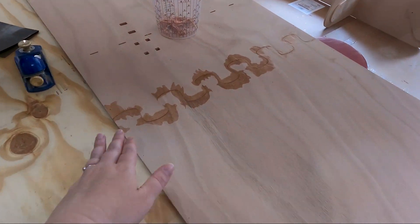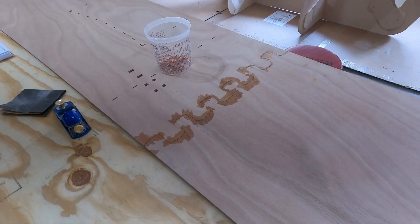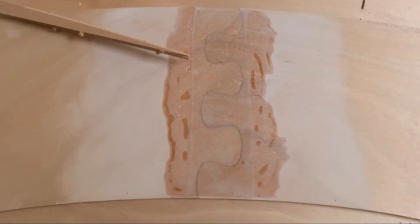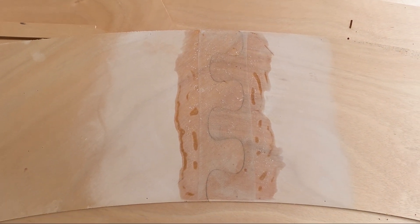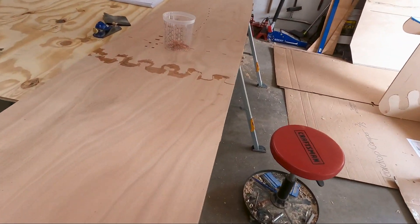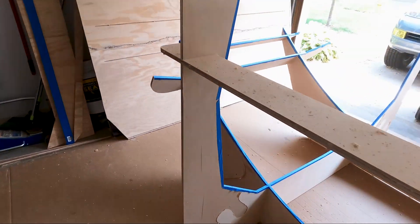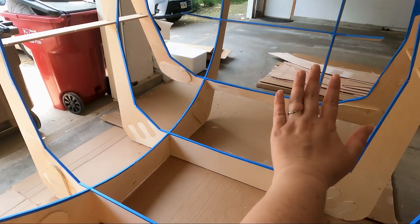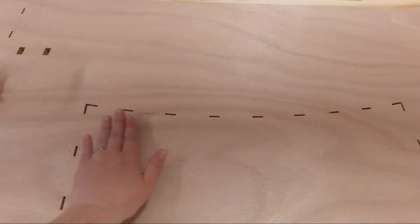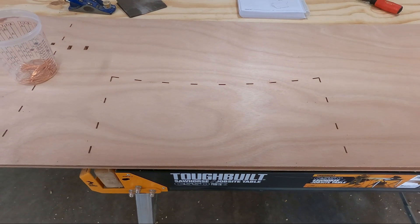Yesterday we fiberglassed — this is the back side, so in between here there's fiberglass on the undersides. This morning we sanded those fiberglass and epoxy sides down from the four panels we did yesterday. This is what one of the joints looks like once it is epoxied, fiberglassed, and then sanded with an orbital sander. The next step is joining these two number one pieces, which will then go into our mold and lay down in this arch to become the ceiling of the teardrop camper. This rectangle shape right here becomes the hatch in the roof.